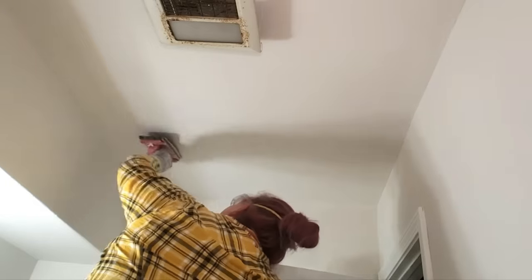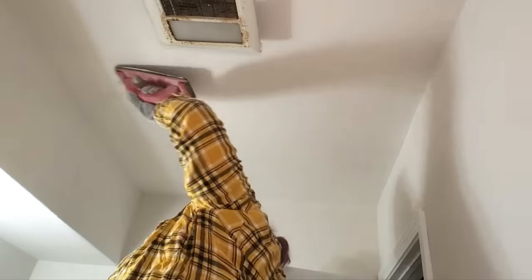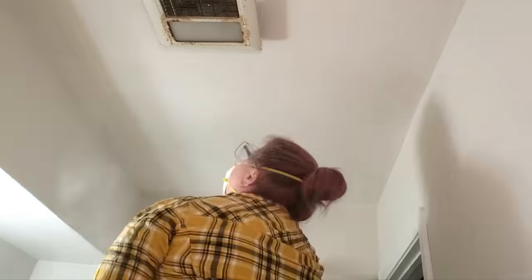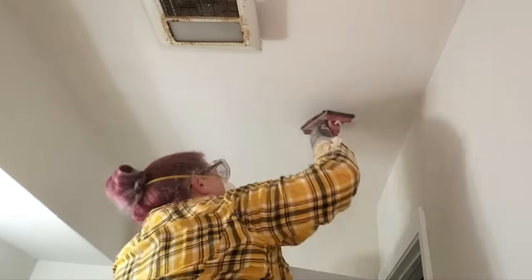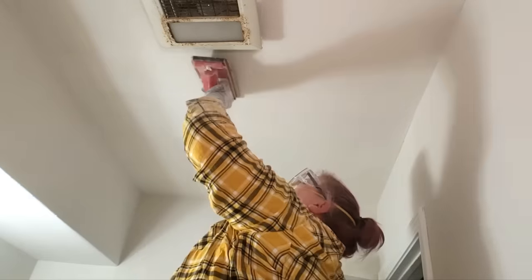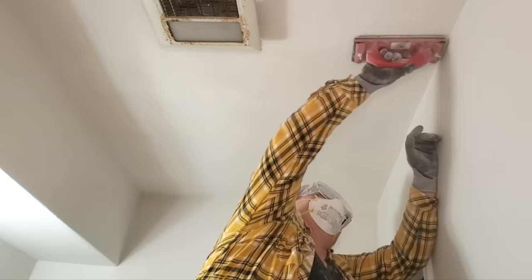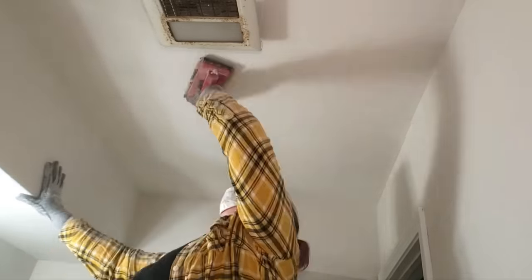As you can see, I had skim coat the walls at this point as well. After the third coat on the ceiling was dry, but before sanding the ceiling, I skimmed the walls so that I could sand everything at once. And doing it this way let me get a nice finished look for those inside and outside corners. So again, if you want to see how I did the walls and the corners, that'll be in the next video.